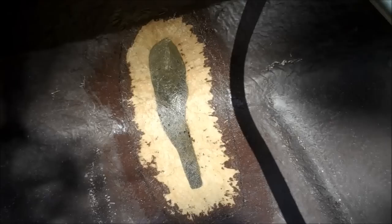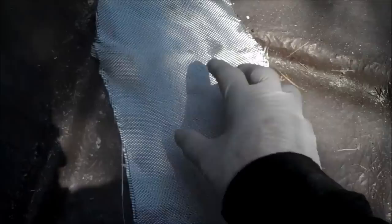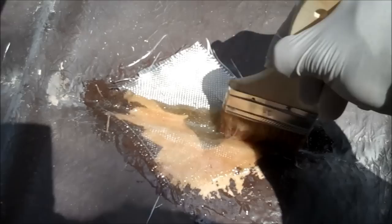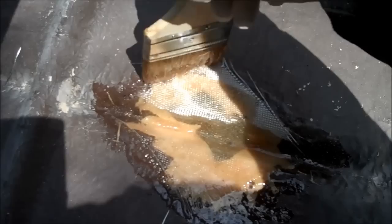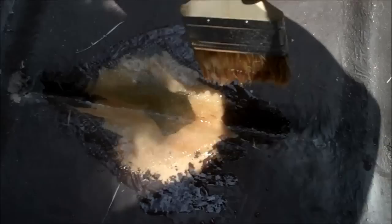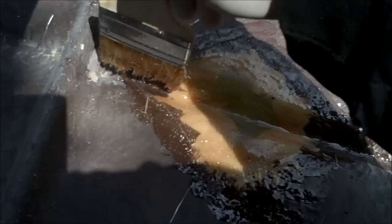Working with resins you don't have to wait 24 hours for it to completely cure. This has been 15 minutes and I'm ready to go to work already. I've cut out a piece of fiberglass cloth and this will be my final layer on the inside. The material itself is so easy to spread — if there's a curve or a bump you can just stretch it out into that area and it smooths out real nice. The best way to put it on is just blotting it in to saturate it. There's really no strength you can count on in the resin itself — the strength is in the fiberglass; the resin just makes it stiff. Some guys will use masking tape to mask off the area, but I really don't care about that here. I will grind all that smooth and then paint over it.